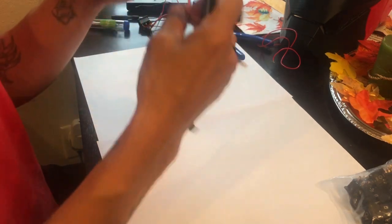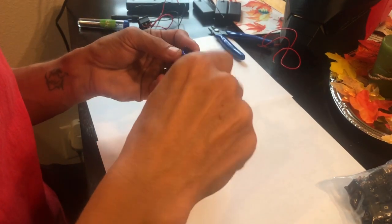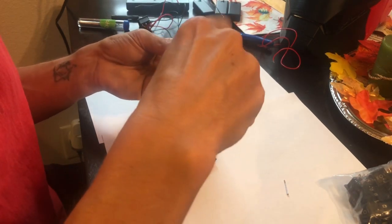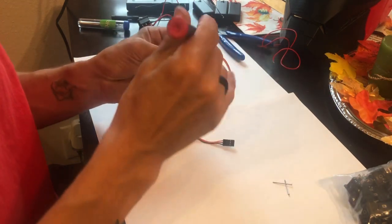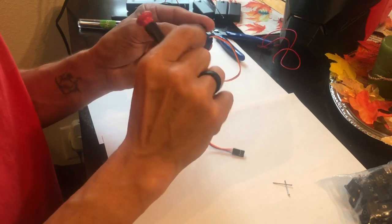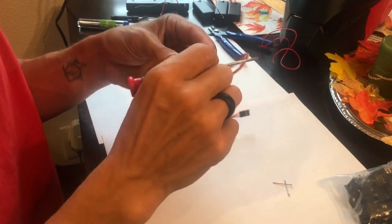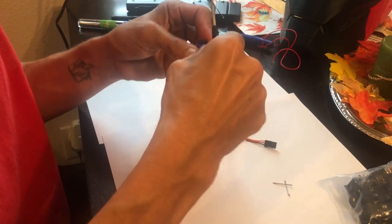The first thing is they come with your typical cable that's got power, ground, and signal. We're not gonna use it off the board, so we're basically going to take it apart. There are two small screws that are pretty long and you have to take those off. Then you're going to have to peel off the label that says SG90 because we have to get to the motor — it's actually holding a little panel on. If you pull on this part you're gonna pop off the top where the gears are, and that's not what we want. We want to gain access to the motor. Just try to get a fingernail or a screwdriver in there.